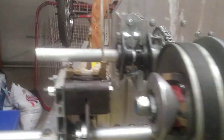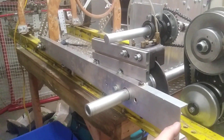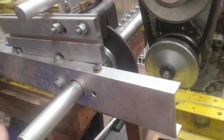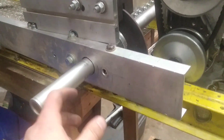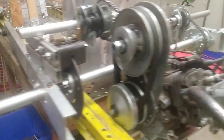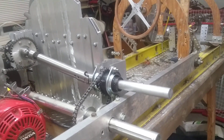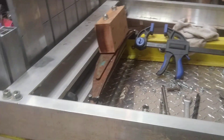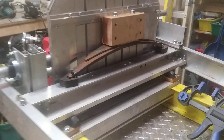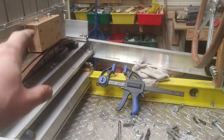I basically have a cycle cart with a rear suspension, and the rear suspension consists of these swing arms. That arm is going to be a fair bit shorter — that's why it can't really move up and down right now, but it will. Here's my rear axle, and these swing arms allow the rear axle to move up and down. Over here, this transverse spring will sit there, and when the rear axle moves up the spring will flex, and so on.